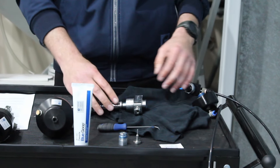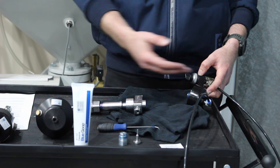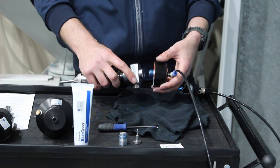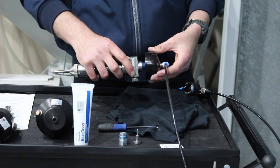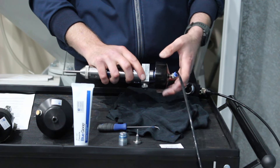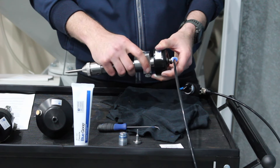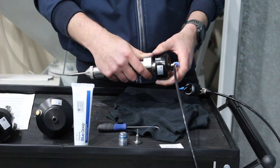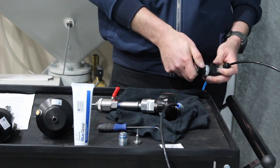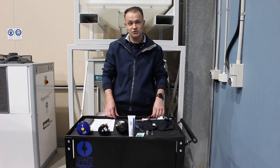Once that's done up we can then reattach this to our actuator. First thing we do before that is turn our air back on just to have the actuator open, to ensure there's no chance of our needle and seat meeting under pressure until everything is in place. We screw that back on — again ensuring threads are clean and have plenty of thread lube — all the way up to a reasonably tight position, then give it a quick flick to get a nice bind. Once we've done that we can turn our air off to close the valve and that is complete. Thank you for watching, hope you enjoy this video and we'll speak again soon.